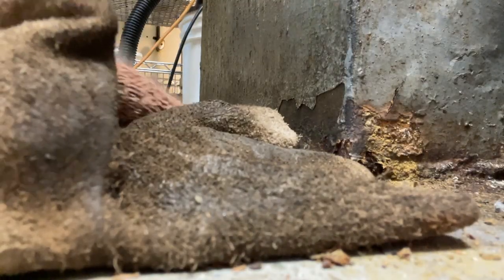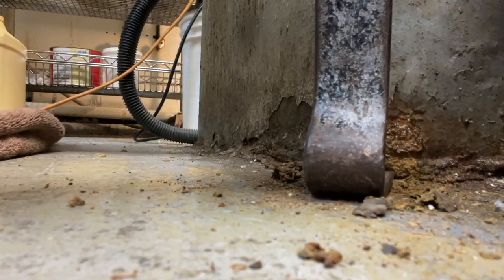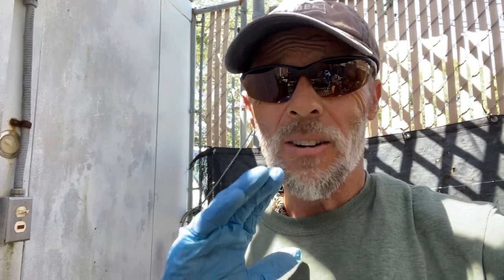It's moving — alright. Worst case scenario: the whole bottom of this grease interceptor is completely rotted out. As soon as I broke it loose from the floor, grease and crap and water everywhere. My partner's in there with a shop vac vacuuming water to the floor drain as fast as he can. The only thing I can possibly do to minimize the mess — we have a back door out here. We're going to try to roll that thing onto a canvas drop cloth and drag it out. Wish me luck.